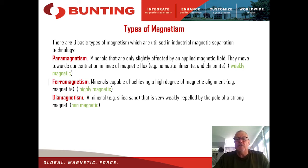Some chemical elements are ferromagnetic, such as cobalt and nickel. Ferromagnetic materials are easy to remove, but they can create a problem when processing alongside paramagnetic particles, as they can block separation and inhibit separator performance. So we tend to remove ferromagnetic particles prior to feeding the stockpile over a higher intensity magnet — what we call magnetic scalping. For the rare earth roll, we usually recommend the feed goes over a low intensity ferrite drum first.